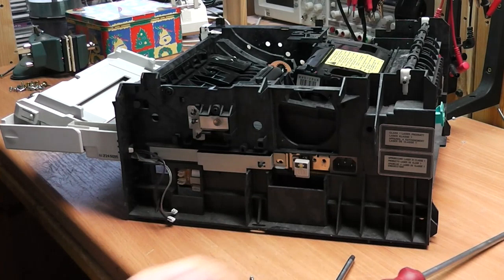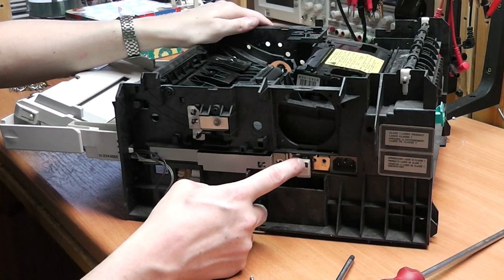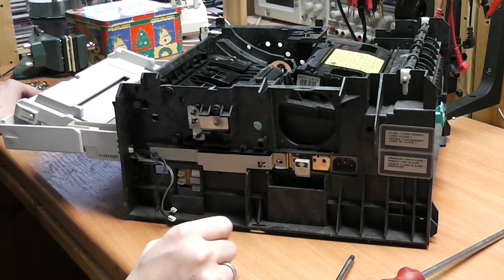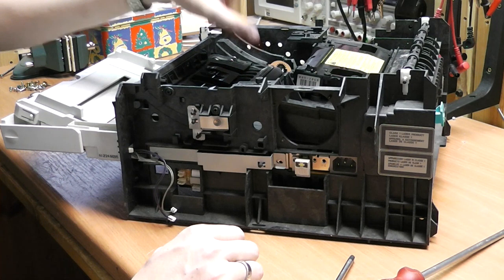So in here, after I took out the fan, you can see this is the switch mode power supply that I was referring to at the very beginning. It actually is a real switch here. You can notice it on the two fixed positions, in and out, and on the clicking sound. And actually the power goes in here, produces the voltages. Usually there's a high voltage output for the fuser unit, so this produces a lot of heat, and some internal voltages for the CPU and for the laser unit.